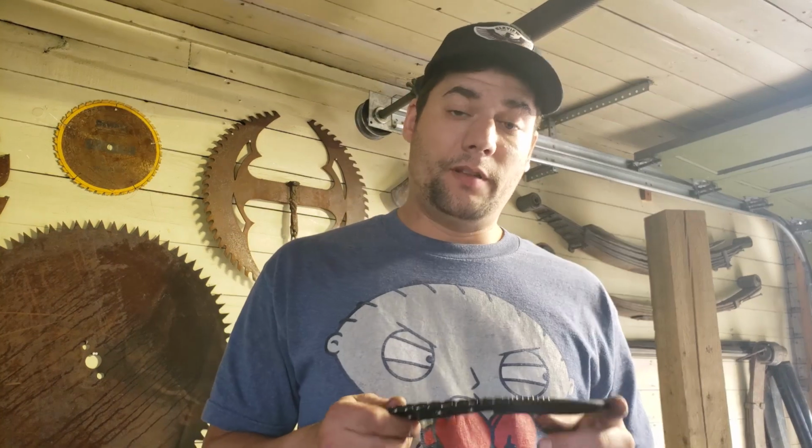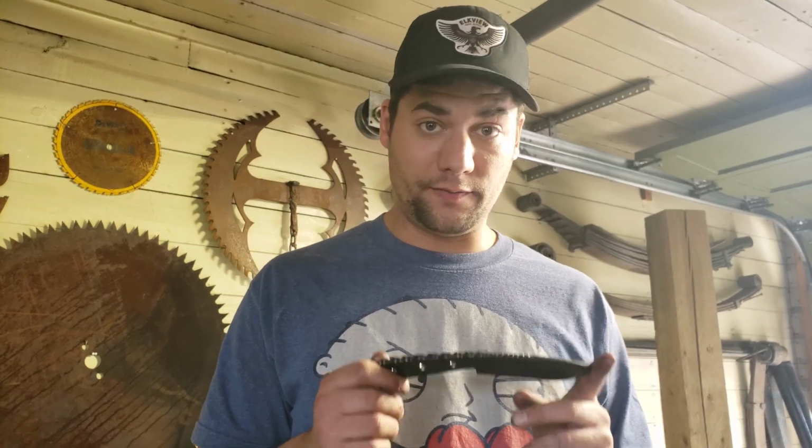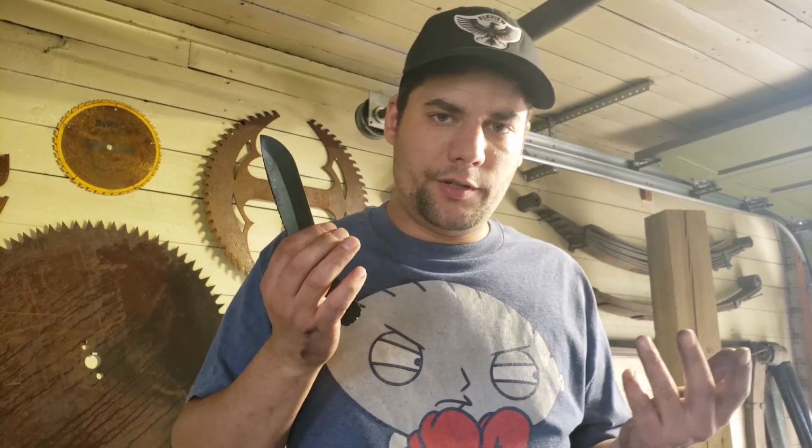So now comes one of the parts I fear and love the most, and that is quenching the blade. A lot of hours have gone into this thing, and if it cracks, especially in a bad spot, it's garbage. I'm a firm believer in blacksmiths don't make mistakes, they make smaller knives, but if it cracks in a few places, trash. So I'm gonna normalize it 3 times, and then we can go into the quench.